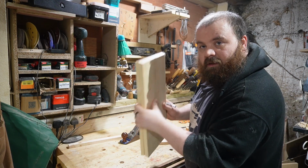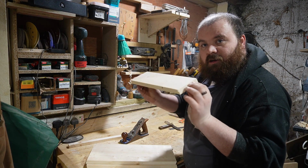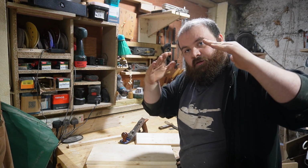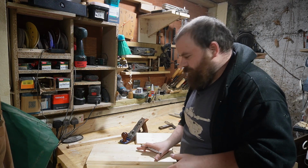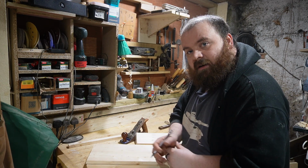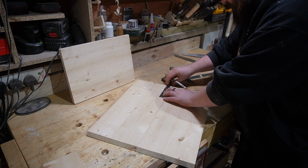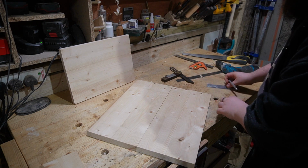So now we have these two cut, that's our sides. And when I was doing that using the same method, I cut our stretcher. The only difference with our stretcher is that the angles, rather than going parallel, they're opposing, so it's coming to a point. That'll dictate our width. So I'm going to grab my top, we'll work out where we want to position this, we'll mark it and screw it. So in my original, about 120 down, gives me a good spread. So we'll check how that works out on this one.